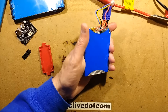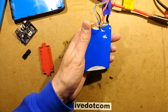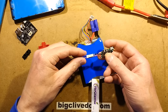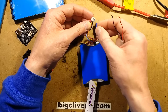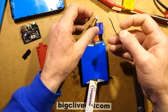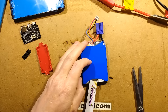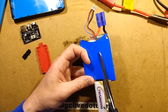I've tested the lithium pack by making a small adapter based on a USB charger. I noticed that the two outer cells were fully charging but the middle one wasn't going up to full voltage, so I think the circuit is completely knackered. I basically treated each cell as an individual cell and charged them individually. I did a full discharge and charge test and it came to 1.6 amp-hours for the middle cell. Let's gingerly start slicing into this pack.